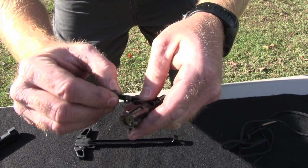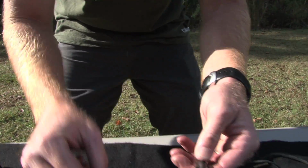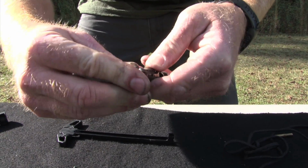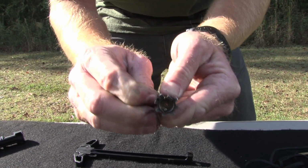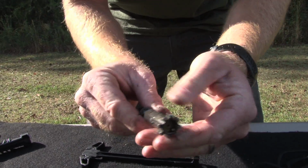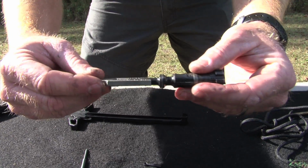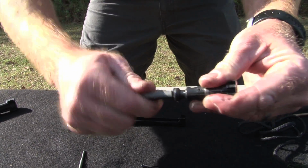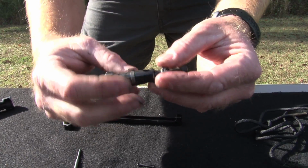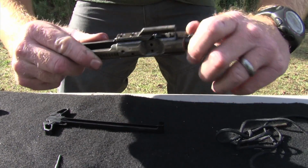As I reassemble this, put this together, and you guys know the tricks here. Push down on the back, get my pin in there, and we need to make sure that when we get this pin in, we've got an even amount of space on either side. All right, just like that right there. When I get this, how I'll clean it is I will take time again with my CAT tool. I will take a little bit of time right here to make sure this is clean, very critical. Then I lube this, get it nice and juicy, put some lube on it. Put this into my bolt carrier, all right?